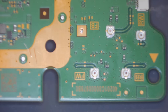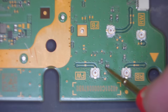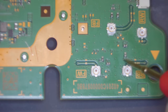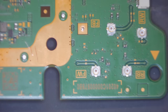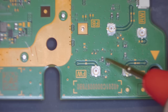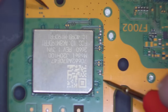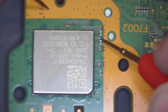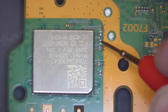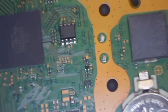Under the microscope, double-checking: this capacitor is shorting, and this one is shorting. If it were just one cap I'd probably try removing the cap, but it's a couple of caps on this side and a couple on the other side as well. With multiple caps shorted it's unlikely to be three separate failed capacitors — what's more likely is that the Wi-Fi IC itself has actually shorted internally.